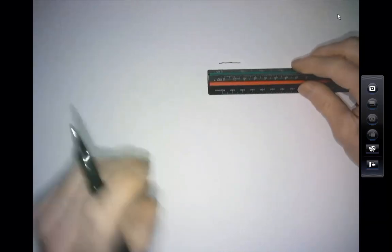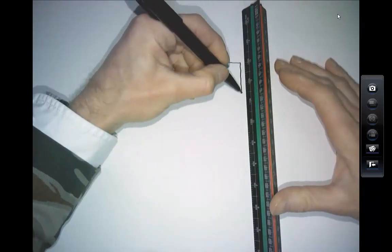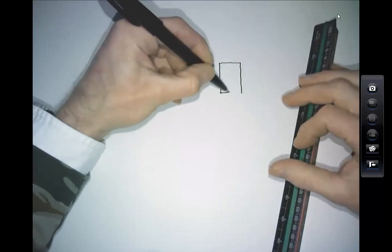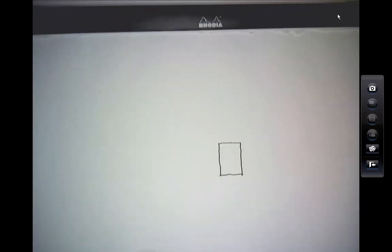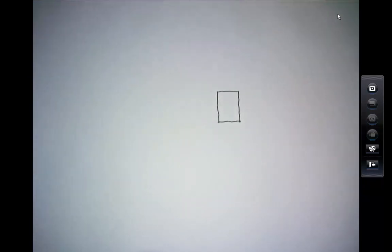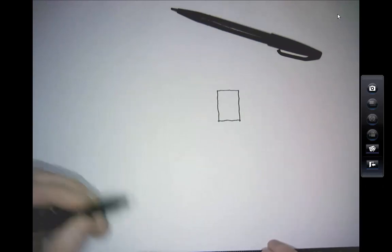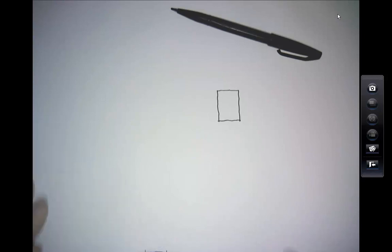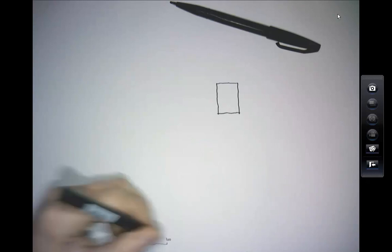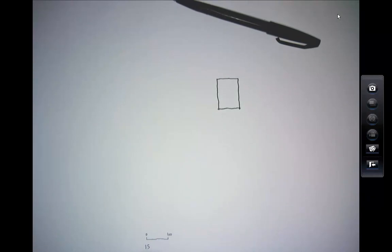At one to five, I'm going to draw this as a 100 by about 150 timber member. I'm using this dotted paper, which you can buy from reprographics. What's great is the dots help you keep your lines perpendicular and square, and once you get familiar with it, four dots equals 100 millimetres at one to five. It becomes a really useful tool when you're detailing.